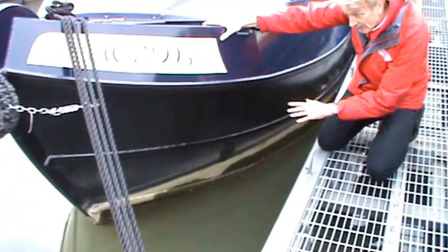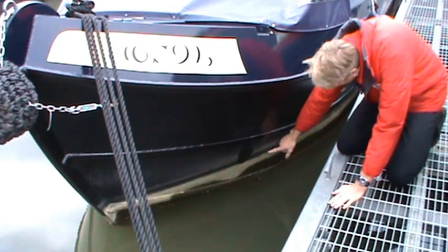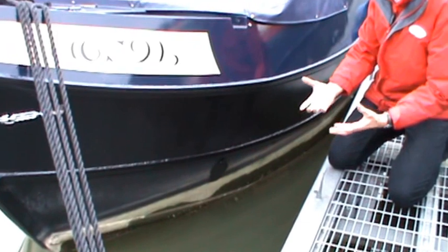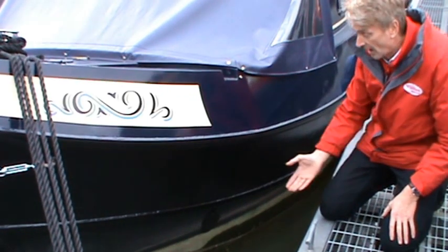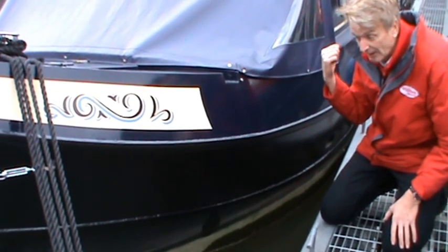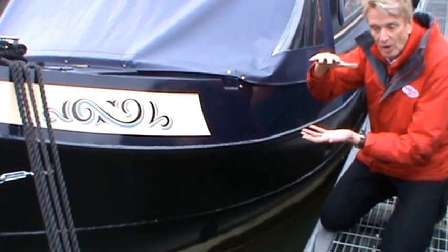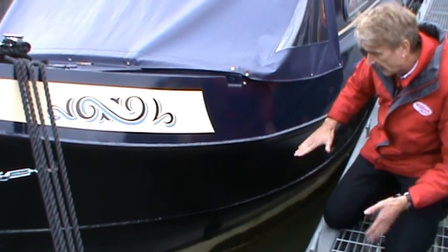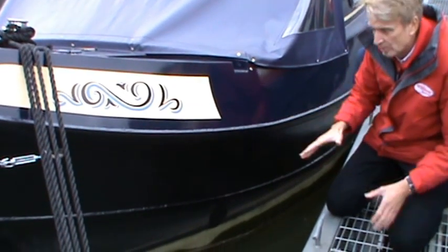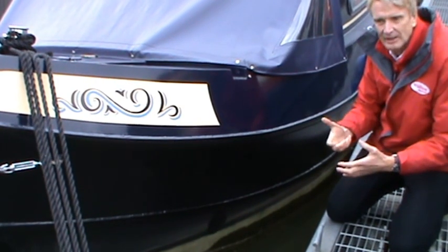This particular customer has taken a lot of his own personal stuff out of the boat as well, so you can see that she's come right out of the water by a good five or six inches, just from the weight of having the water tank emptied and the diesel tank filled up. The diesel tank needs to be filled up for winterizing to stop it condensating, so this boat has gone from being level at one point to now really high up in the water at the front. That is a thing we talk about in the boating world called trim, or ballasting the boat.